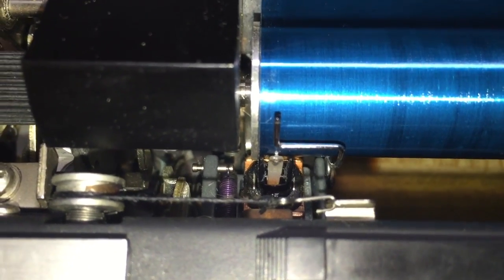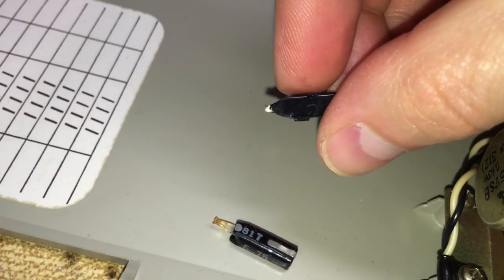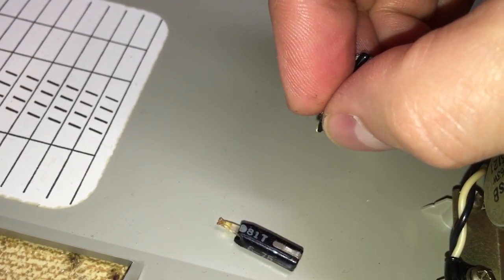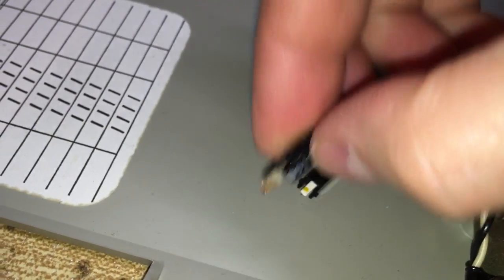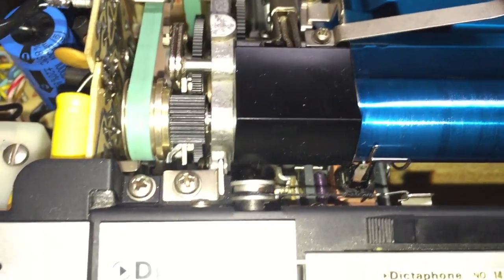And again, that stylus in there that you see, the plastic piece, they trimmed it in order for the stylus to reach to the record without that built-in part on there. You'll see that these styli are actually little mini cartridges. So they're ceramic cartridges with a stylus on it already. And so the Dictaphone company trims off that triangular end that you see there by my thumb and makes it more like this, although they didn't quite cut off as much as I did to try out a different stylus in it. So I found that the one that's built in works better than any of the spares that I had laying around, probably because they're old and so forth.